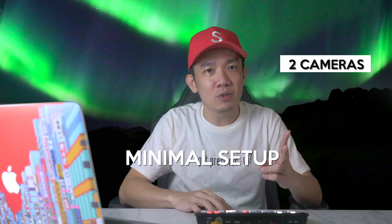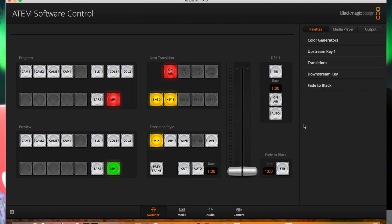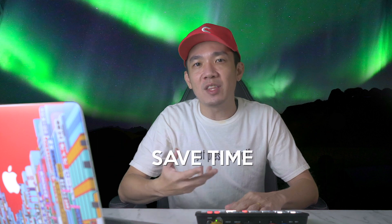Because today we are going to focus on what a key function can do, I have a very minimal setup — just two cameras connected to ports 1 and 2. Port 4 is connected to my laptop's HDMI, and the ethernet port is connected to my laptop via a USB ethernet adapter, so I can have access to the ATEM software control. I'd always like to connect port 1 to my main camera and leave port 4 to my laptop. One quick tip: it is good practice to keep your setup consistent, because whenever you go on site, you automatically know which ports to connect to based on your existing workflow, and if something crops up, you'll know which camera or port is having the problem.